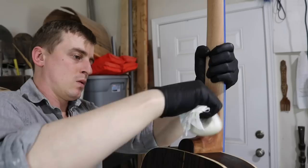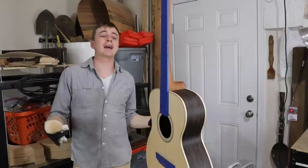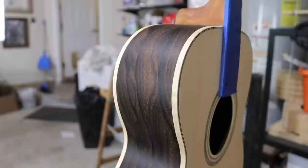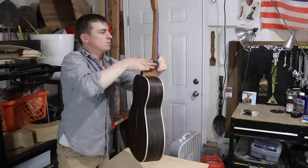Next I do the sides, then the heel, then I jump to the headstock, and last I do the neck shaft while I support it from the taped fretboard. Done with the first coat — now I just have 14 more to go. The ziricote looks crazy. I think it's just going to keep looking better and better with every coat. Now I'm going to let it dry for three hours and then come back and do coat number two.